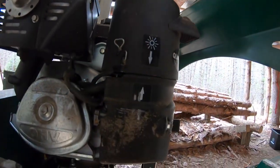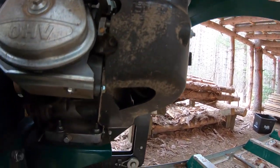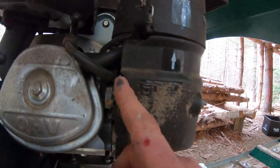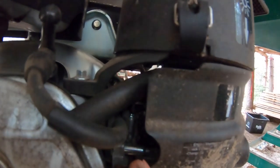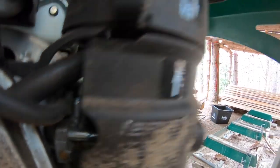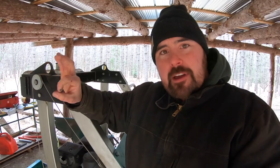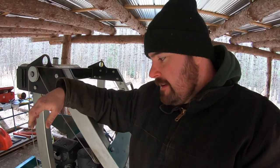So listen - try to figure out if there's a tinging sound going on. If you hear it, if it sounds like there's a loose spring or some sort of loose metal flapping around, turn the idle adjustment screw down. Let me show you exactly where that is. The idle adjustment screw - there it is. Look off the top of my index finger - there's a little screw, mine's a black plastic one. If you were to turn that to the left, loosen it off a little bit, that'll bring the idle down. You'll know you went too far when your engine stalls. If you can bring it all the way down to the point where the tinging sound goes away, that's exactly the sweet spot - that's where you want to leave it.